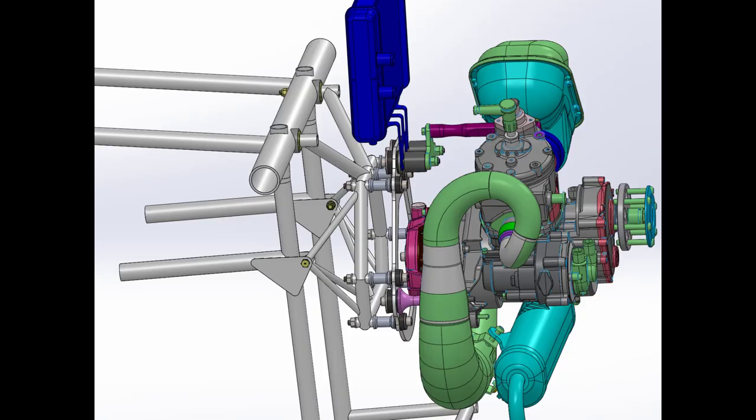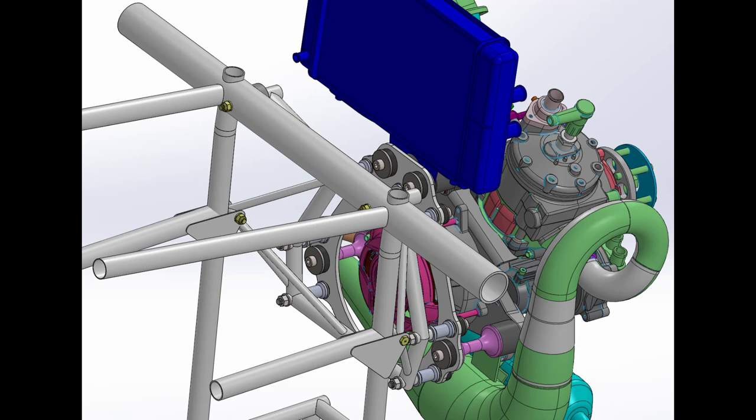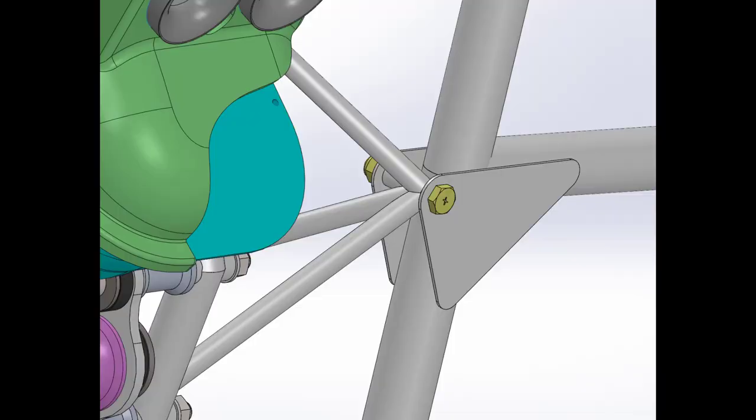And you can determine at that point whether you've got enough strength in the members that you're using so that they don't distort unduly. You can fine tune your mount structure by going with a thicker tube or a thinner tube, or you find that there's no load on a tube. You can play with it to try to get the best uniform stress loading, so that nothing's overloaded. It's smart to have that done by somebody who really knows what they're doing. An aeronautical engineer knows about aircraft loads, so it's best to go with one of those guys.